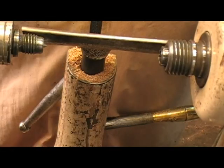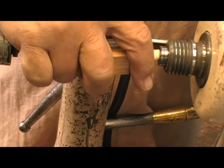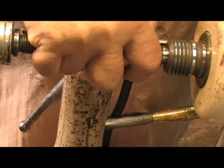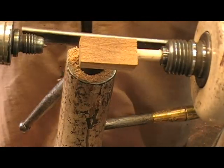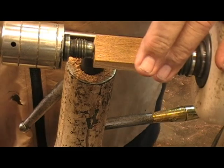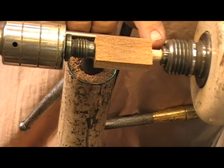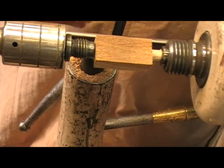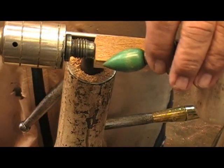Let's get this party started. The collet chuck is in here and I've got the drawbar on it — that's how I'm going to release it. I'm just going to shove it into the collet chuck. If you hammer on that dowel hard enough you'll distress the end of the hardwood dowel and it doesn't want to slide on real easy. So we just give it a little bit of a push. Now I've got my tailstock up, got it in the collet. I don't tighten the collet — don't need to, it's going to hold enough on the friction. My pattern is the one I turned earlier, so that's what I'll use for my basic pattern.